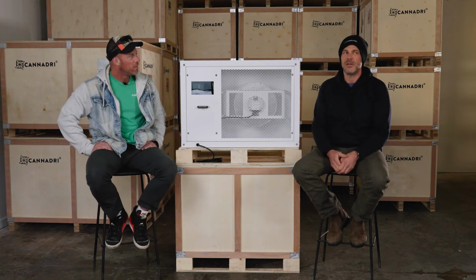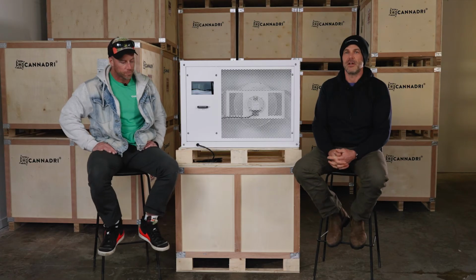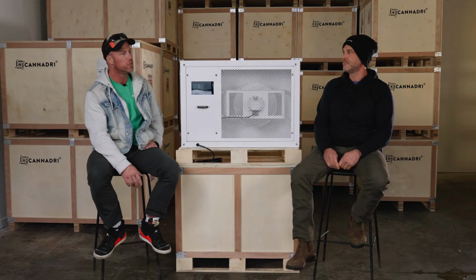And that would be more of an accurate number, what you might see for that space, right? And a lot of these drying spaces now, everybody wants to cure at lower temperatures. Everybody says it kind of protects the trichomes, protects the terpenes. There's less degradation when you're curing at lower temps. So doing those lower temps also means that the capacity of your units is far less than what the units are spec'd for. So a lot of the time you're going to have to somewhat over-spec if you're doing the formulas of dividing your biomass weight over the period of the drying time. Or find out the capacity at a given condition, right? If you want to cure at 58 degrees or 60 degrees, get that information from the manufacturer, or from us, wherever you're sourcing your dehumidifier, and make sure you have that number